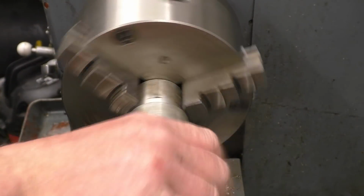It's not super accurate, but to there. Before I tightened the headstock bearings up on this lathe, there's no way it would have parted that off without chattering. That's how you break a tip, bastard. This last batch of tips I got from Banggood are nowhere near as good as the first lot I got. I'll have to get some more.